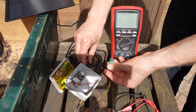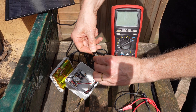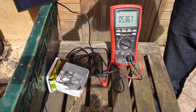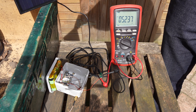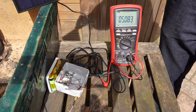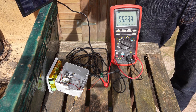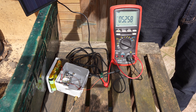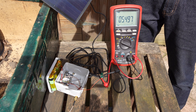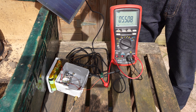Let's connect the solar panel directly to the board and see what happens. We see a 5.2 to 5.3-volt input when connecting the solar panel directly to the RAK wireless board. That's actually very nice — it does not exceed the 5.5-volt limit as I feared. Of course, 6 volts was the open-circuit voltage; obviously when there is a load, the voltage drops a bit, which is just perfect.